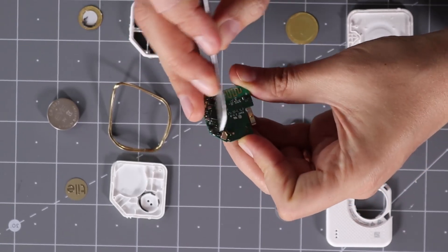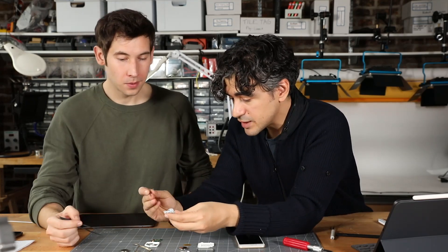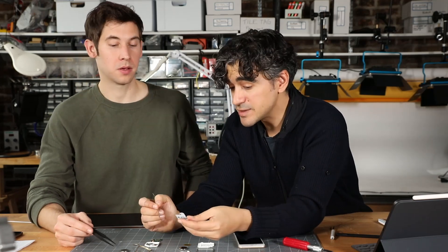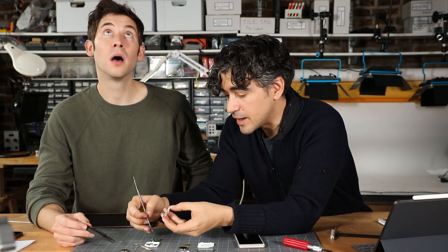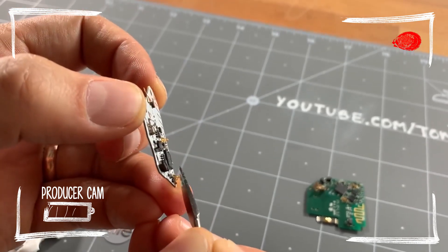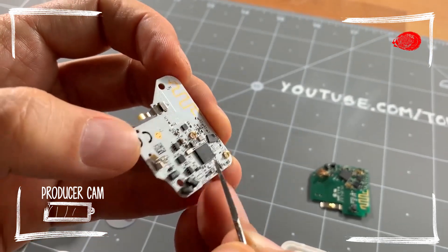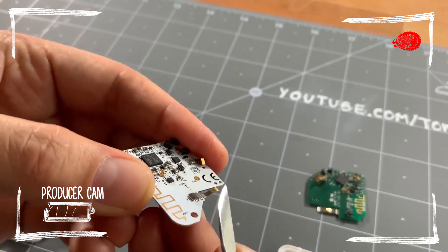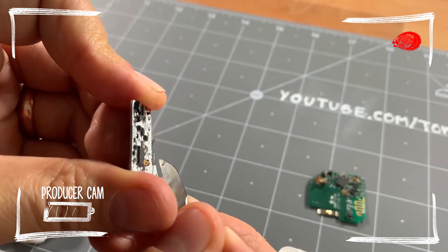The cool thing about gold is that it doesn't rust and is very conductive. In the new version, they've thrown out everything they did in the previous one — which is interesting because they've kept a lot of stuff — but their contacts they decided they could do better. For the piezo, they're using a coil spring — this little conical coil spring, which are so cute — also gold plated. And then they've switched their leaf contact style for the battery, probably because this is a more appropriate design for a replaceable battery.